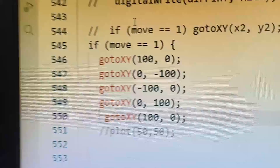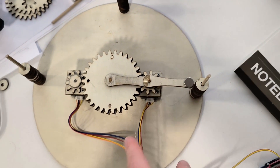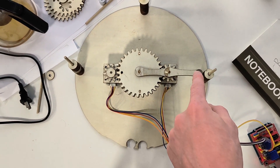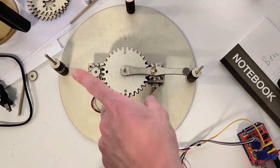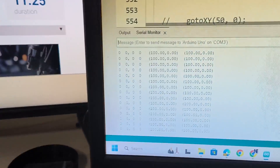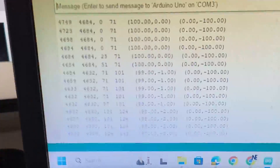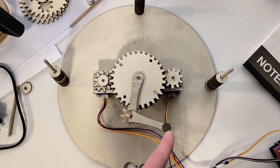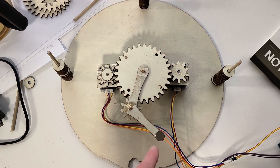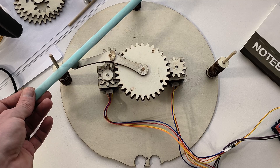I finished the program over my holiday. It can go to a given angle and it'll take the shortest distance. Right now I have it in linear mode, so it's going to go from here down to this point, up to this point, up to this point, and back — making a diamond. I'm going to activate it by pressing one, and you can see the current location here as it does the conversion and extends the arm in a linear path.